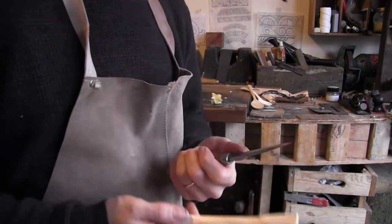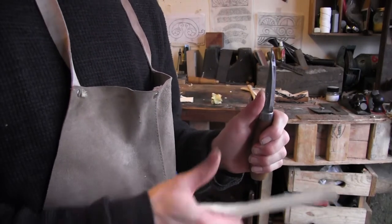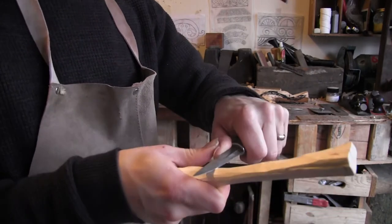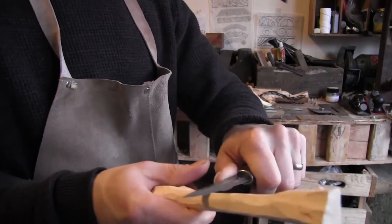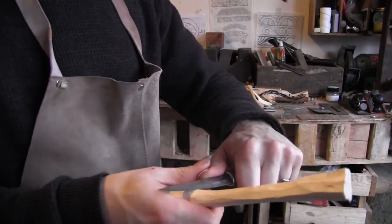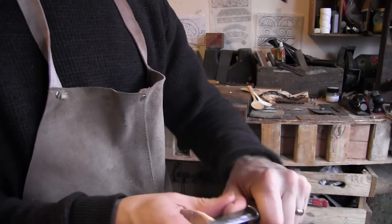And so the second cut I'm using that you're seeing a little bit, this is the main whittling cut, the push cut. So you have one thumb behind the blade, and then this thumb goes behind that thumb. Cross it over the wood and push like this. It can feel a bit uncomfortable to begin with. I usually notice with students, maybe 15 or 20 minutes, it will start to look natural and they'll get comfortable with it. It's a really good way to carve.